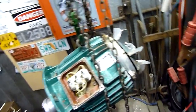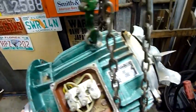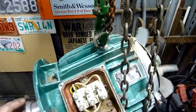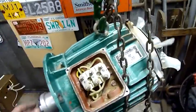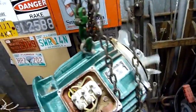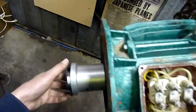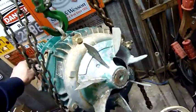Because you can excite a three-phase motor that's being externally driven and use it as a generator. There is something to think about though — it won't end up as a very large power unit, but it would work. It's an interesting little idea. I believe this motor's still all right — I haven't tested it yet, but we can always do that. I keep making things more complicated for myself.